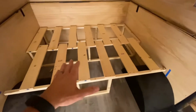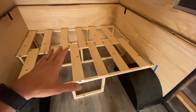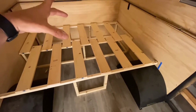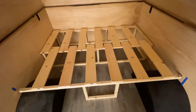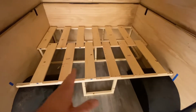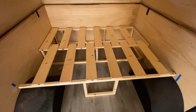I know that these holes are big, so I'm gonna test this theory. I'm gonna get some plywood and cut it into two even sections, 30 inches each. Put one there, one here, and then see if we sag at all. I don't think we will. I'll just use like a piece of 1/2-inch plywood. These are less than 16-inch centers. So it'll be good. Should be strong, and it will sturdy everything up.